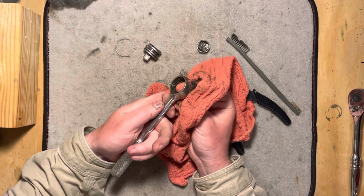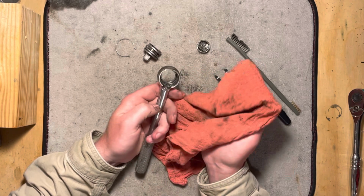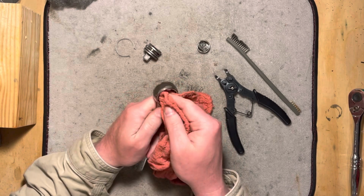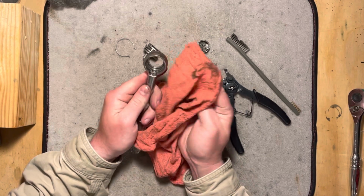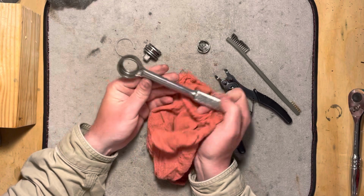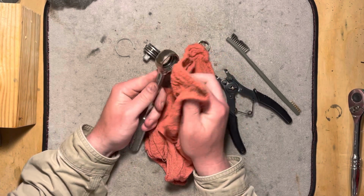I don't prefer this mechanism as much anymore. I don't think it's as good as some of the newer systems for doing things, mainly because your handle now has a wear component in it. You know, these teeth could over time become worn or chipped, somehow damaged, especially if you're beating on the thing or something. And so then you've got really the main body of the ratchet. You know, think of it as the receiver has parts in it, pieces of it that can't be replaced, and if they wear out, you've lost the whole thing.